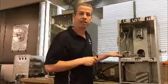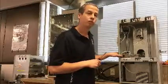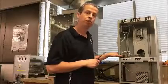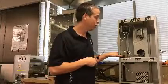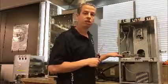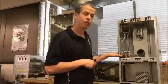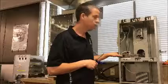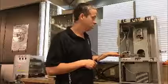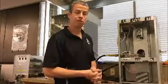I've lit the pilot light again, and now this time I'm going to hold down the pilot button for a minimum of 30 seconds, and hopefully that should be enough time to energize or produce enough voltage out of that thermocouple that will maintain the pilot opening. Okay, I'm going to give this a try again and let go. And you want to let go slowly. And now it's on. So it's very simple in that manner.